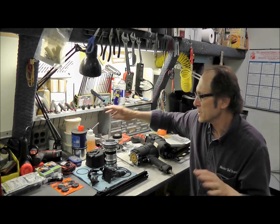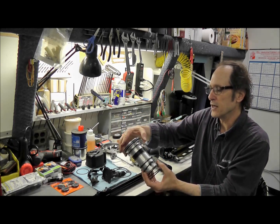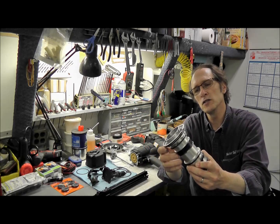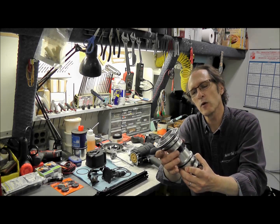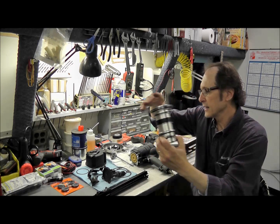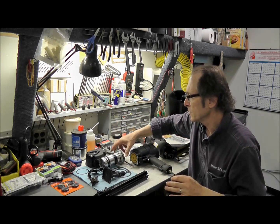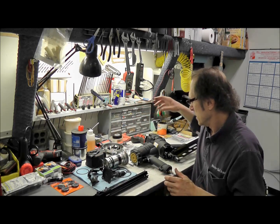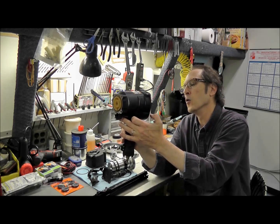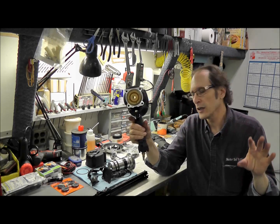Typically what goes wrong with these Hitachi nailers is not a whole lot. It's typically O-rings, because this moves back and forth and you've got several O-rings here. This big rubber band — it's actually an exhaust valve. When the air goes inside and comes back in cycles, this rubber band expands and allows the air to go inside, shoving the cylinder back against the top cap — it's sort of like a check valve. That can break from time to time. The spring in the bottom typically doesn't break. What you'll have is O-rings inside your trigger valve assembly that wear out because they're being depressed. Any O-ring that has dynamic movement on it is typically going to wear out first.